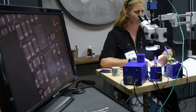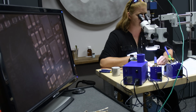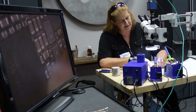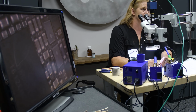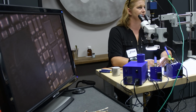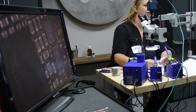Okay. So now we have one of the other things that was missing couldn't have possibly been the problem. But these guys here are on a different line, and the name of the line is called PP VCC main. What do you guys think PP VCC main is? Sounds like PP positive power VCC. This sounds like main artery, main power rail, and experience tells you that that's certainly the case. So this is the aorta.